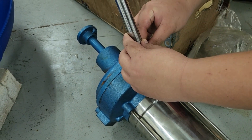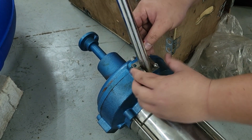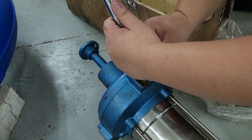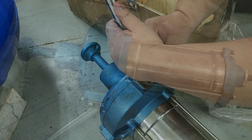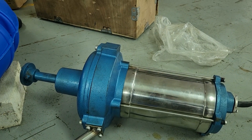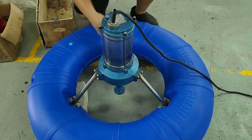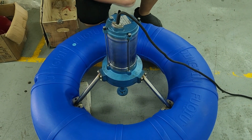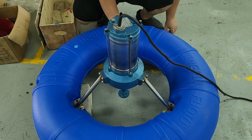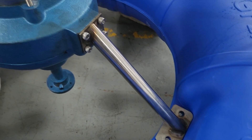I feel it's actually easier to install than the paddle wheel. You first install the stainless steel stand that's supposed to hold the motor body between the float — it's just a minor standoff made out of stainless steel. You tighten a couple of bolts, and you can see one of them being installed. On this motor there are actually three of them, installed at every 120-degree angle. After that, you put it on top of the float before installing the screw that fastens the frame onto the float.